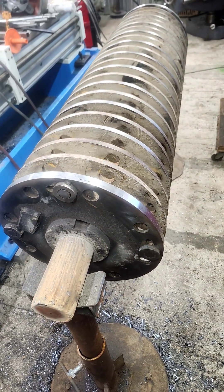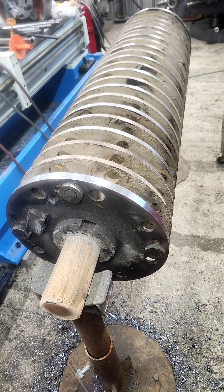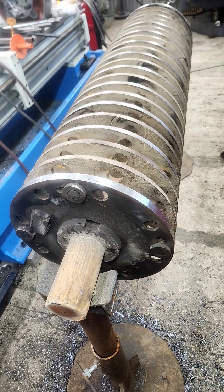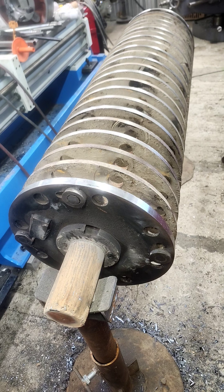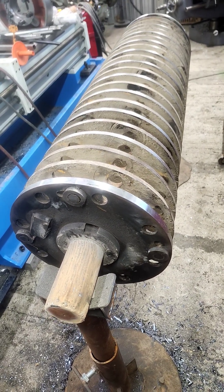Keyways were all dished out to eliminate the corners, filled in, and cut back down around before welding. Just everything you can to avoid any kind of stress risers or uneven heating or risk of cracking in these is essential — you'll run into problems otherwise.